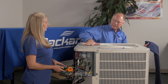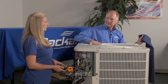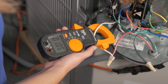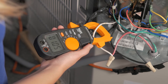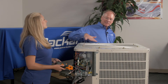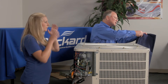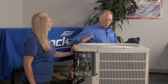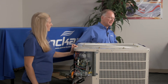We're going to look at the amps, then we're going to cover it to simulate adding static pressure. Let's see what our amps are with no added static pressure — 1.05 amps as it is. So now we'll add static pressure.